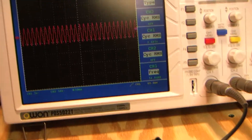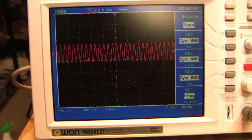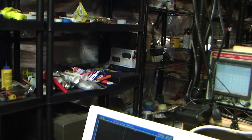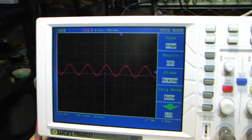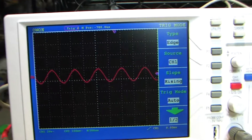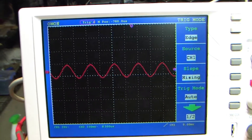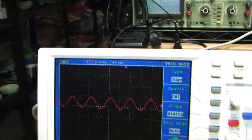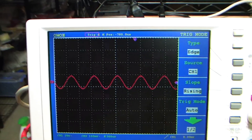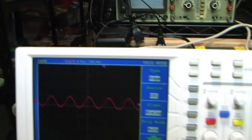One more thing I want to try — I'm going to get a quick look at the frequency spectrum, the Fourier transform. I thought it might be fun to look at the frequency spectrum to determine how this thing distorts and where the distortion correlates with the 100 watts — what's happening right prior to 100 watts, and which harmonics are being produced during the distortion process.